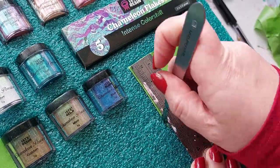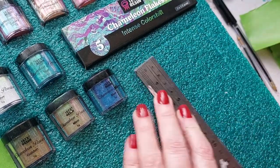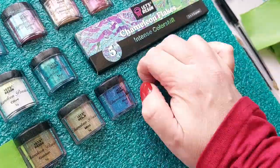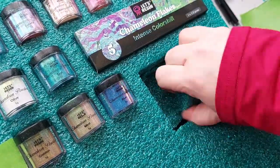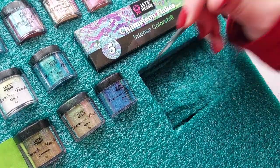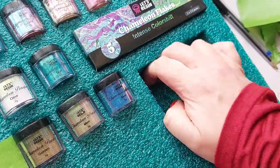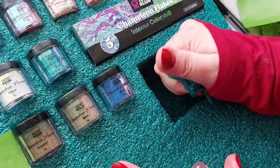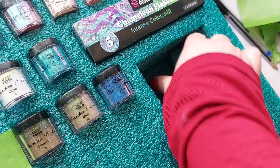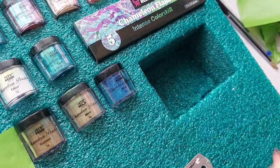To cut a hole deeper, you just have to keep going down. My first cut is just the surface, and then because it's layered foam I'm going deeper and deeper each time with the blade to get right down in there. You can see me digging it out, making sure the box fits nice and snug. The last thing you want is to cut a hole that is too big — it's okay to cut too small because you can always make it bigger, but if you cut too big that's a problem. You can see the defined lines between those layers.